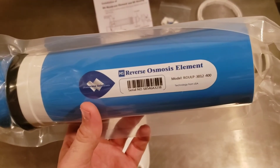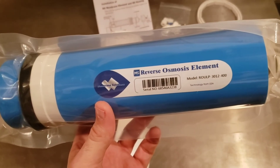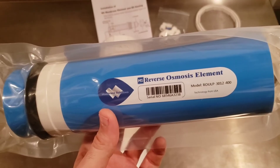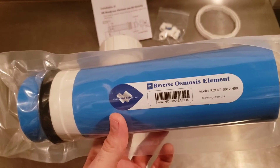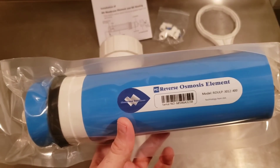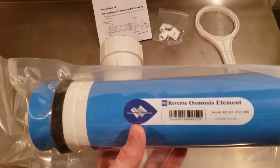We already mentioned the need for a high-pressure feed pump. Pumps are selected using a pump curve, which compares operating parameters such as pressure and flow rate. For our use, we want a pump capable of providing the desired flow rate at our target operating pressure — 100 psi for these membranes. Both pumps I mentioned are capable of achieving the appropriate flow rates to have good recovery rates using these membranes at 100 psi.